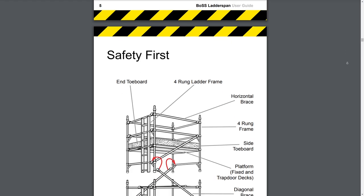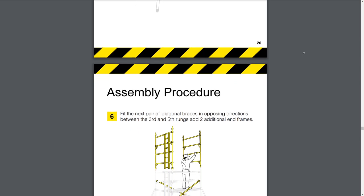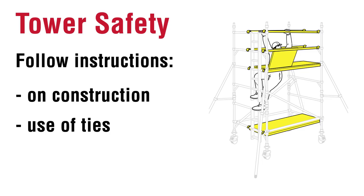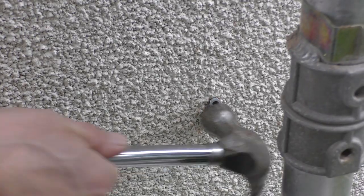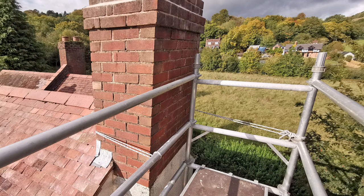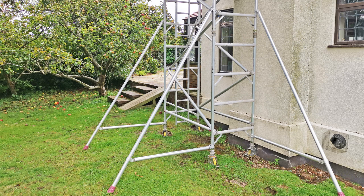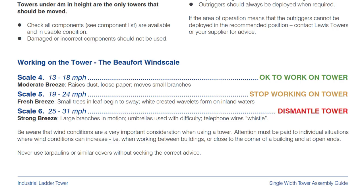I'll post links in the description below, but they all emphasise the need for safe construction - in particular having the guardrails or horizontal braces in place before you construct the next level. It's also recommended to use two-way ties with load-bearing couplers every four metres up the tower. I improvised at four metres with a vine-eye and rigid garden wire, and at eight metres with a rope tethering the tower to the base of the chimney. We've also got stabilisers, but I wouldn't fully recommend my approach as it left a little movement in the tower. Finally, don't use the tower when it's too windy.